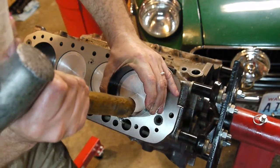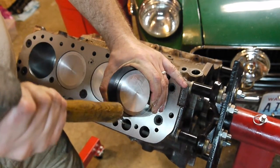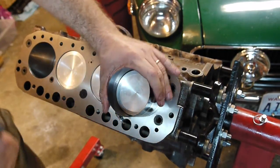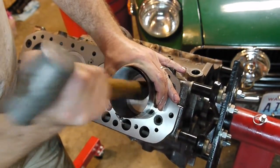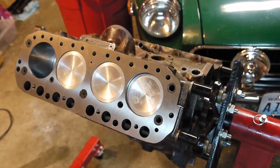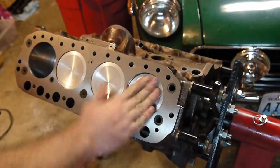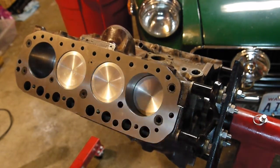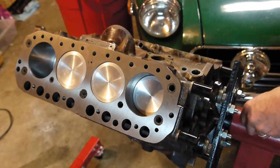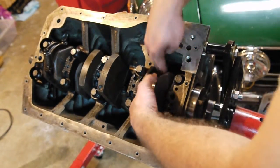So I'm applying downward pressure on the sleeve. Looks like I got it lined up about right. Here we go — I don't know if you can see that. You can kind of see it going down. On three: one, two, three. Easy for me — I can actually push that down with my fingers. Let's go ahead and rotate this over. It's nice and snug in there, it's not going anywhere. I think I need to push it back down a little bit to clear the bearing here.